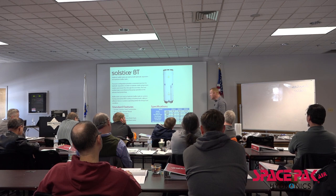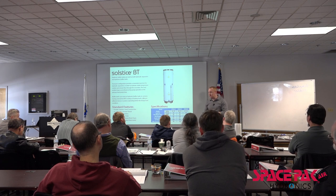Now, keeping in mind some real low load homes that are in the 10 to 15,000 BTU range, if things got real crazy, they could run the whole house just on those elements. And still with a COP of 1, right? Because we're not wasting any energy, we're just dumping it into that empty tank.